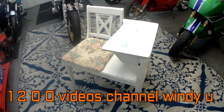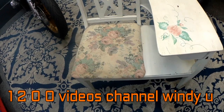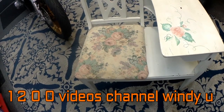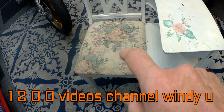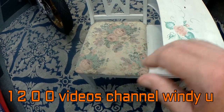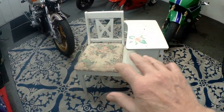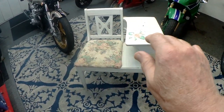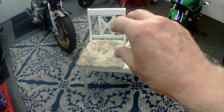The first part is I've got to set up my work table because we haven't been working outside lately — waiting for a day like today where it's not raining. I have to remove the cushion as the first step, and we're going to make a whole new cushion. Then I'm going to sand off the paint — not down to bare wood, but just enough to get a rough etched surface so that the new paint sticks.